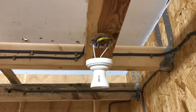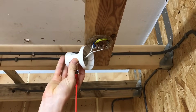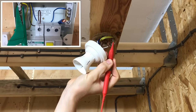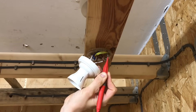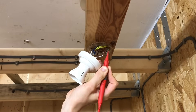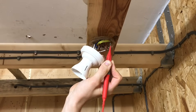Moving to a different room in the installation, this light fitting is all plastic so there's no metal bodywork to test. We just test to the actual earth terminal to make sure the CPC is continuous to that point. Probing onto the terminal we get a reading of 0.09 ohms. So we've taken three different readings so far and we need to bear in mind that whatever reading is highest is the one we record. So far the highest reading is 0.13 ohms — unless we get anything higher, that will be the one we record. Let's check the other switches now.